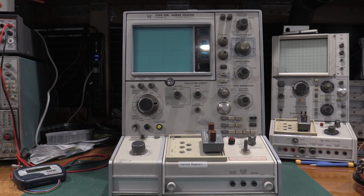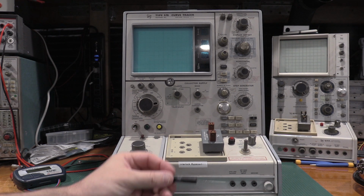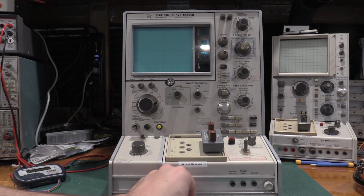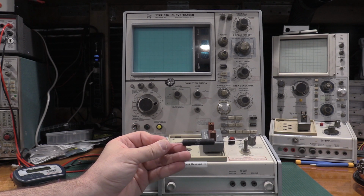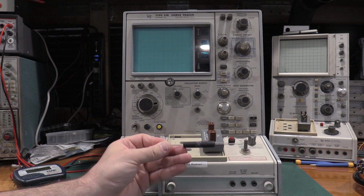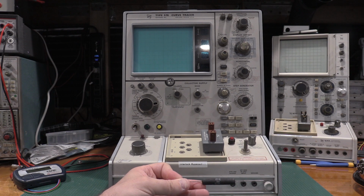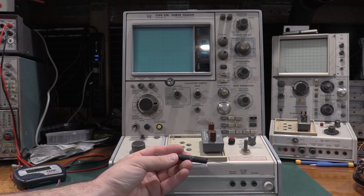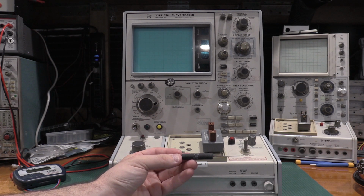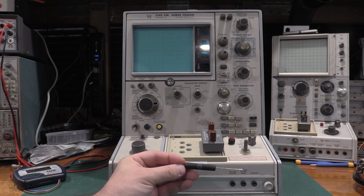Some of the resistors, which I have, their tolerances are incredibly tight. The service manual calls for 0.25% tolerance, and you need some pretty beefy resistors. I mean, this guy's 1 ohm at 10 watts. So you've got to get a 1 ohm resistor within 0.25% tolerance to have the curve tracer be in tolerance. So that's actually a pretty tall order.